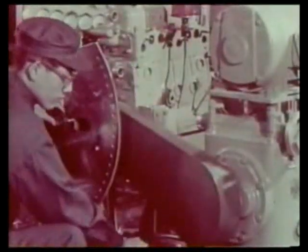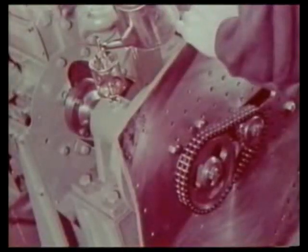Some believe that roller chain drive is prone to chordal action, but designers after bold uses of many chain drives have not found such action a problem. The engagement of the chain and the sprocket is effected in a circular arc, indicating that the contact pressure is extremely light compared to the engagement of two gears. Moreover, the load on each tooth is quite small since the rollers engage about half of the sprocket teeth. The endurance of sprocket teeth is therefore far higher than that of gear teeth.